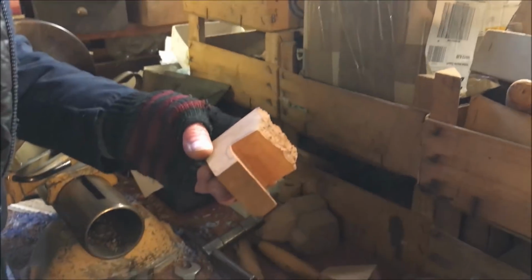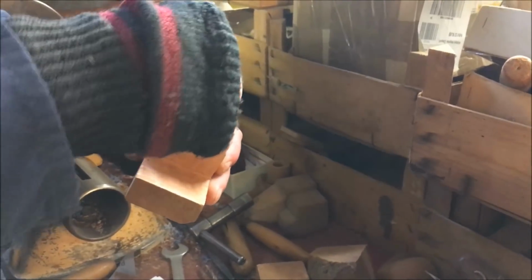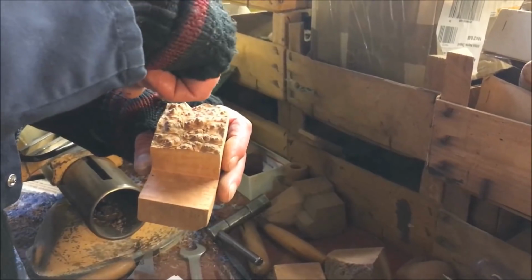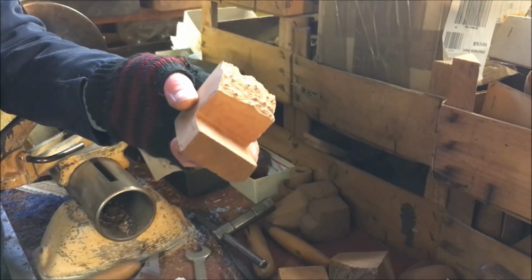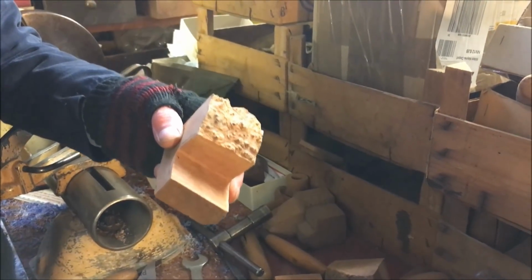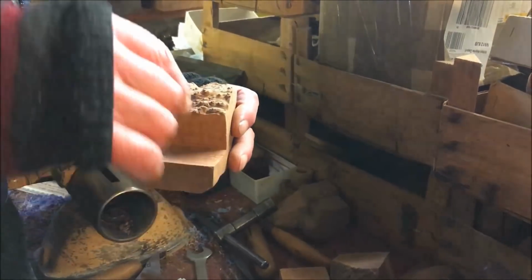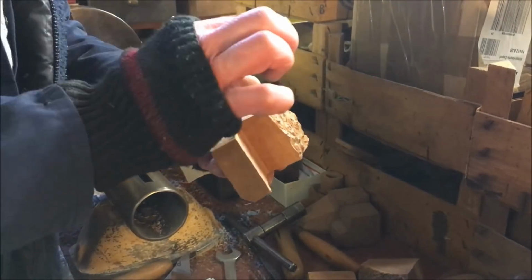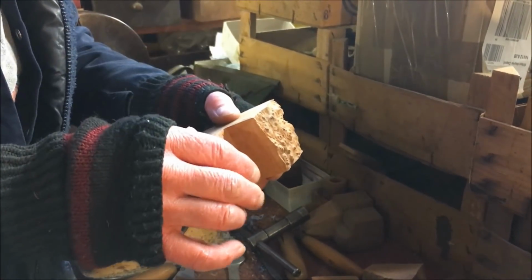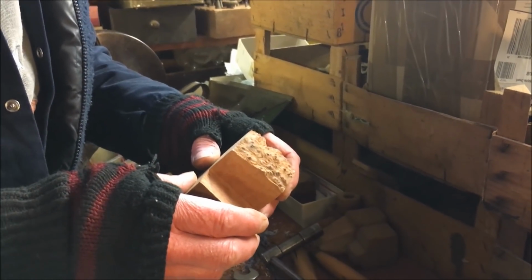So where would you go next if you're doing a freehand, if you're not using the lathe for that? Is that straight onto a sander? Yeah. But if I were to drill this and then trim it, trim the start of it anyway. The thing with freehands, they're not always symmetrical. There's more at the back than the front, perhaps. But if you can get a guideline around the outside, just take down the first centimetre or so. So would you do that with a bandsaw initially on a freehand? If you can, get a rough shape out.